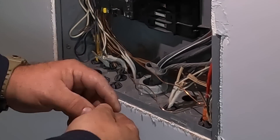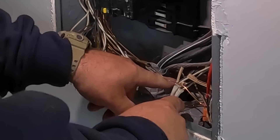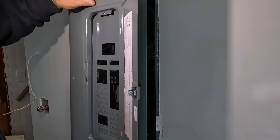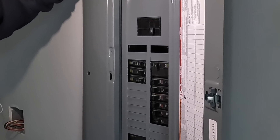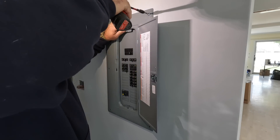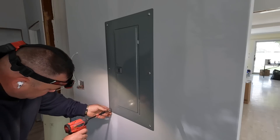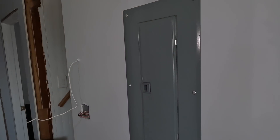This panel used to have all the circuits for the whole house. After we dismantled the old kitchen, we got rid of a lot of old circuits — everything in the kitchen, hallway, bathroom, master bathroom, master bedroom suite, and closet area. All new circuits over there come from the new main lug panel in the basement. All those new circuits are required to be arc fault or GFCI protected up to current 2020 NEC standards. I get that question a lot in the comments — I'll be installing arc fault circuit breakers in this house.